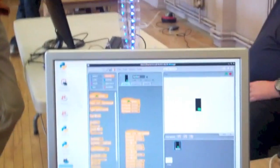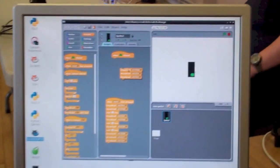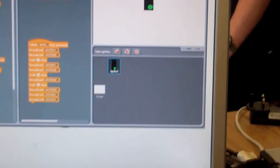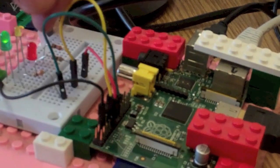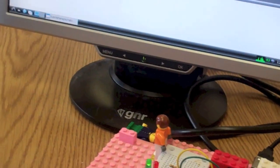So you've simply got a program here. If you're used to Scratch, you press the green flag. It makes the green light come on — it switches pin 13 high, pin 12 low, pin 11 low. These are the pins on the GPIO connected up to the LEDs. The red's connected to 11, the yellow's connected to 12, and the green's connected to 13.